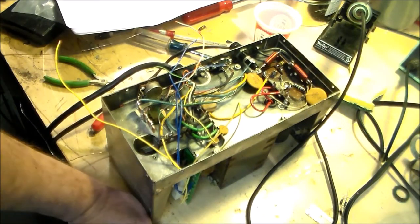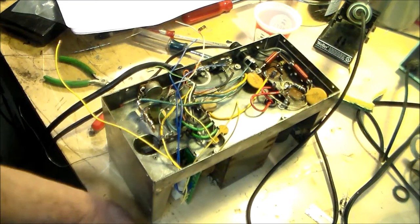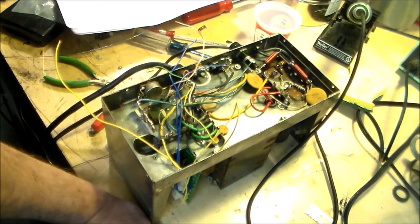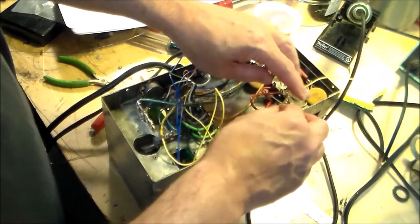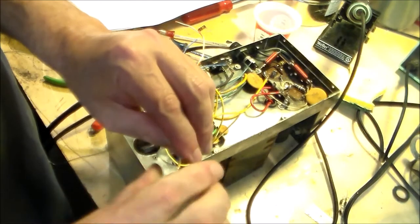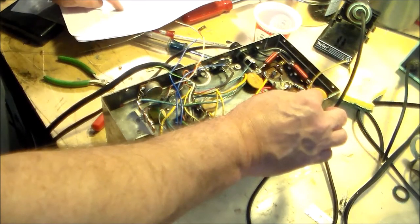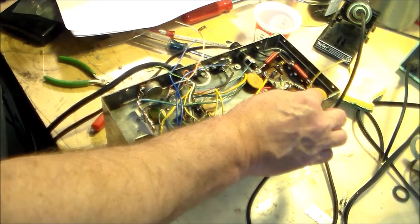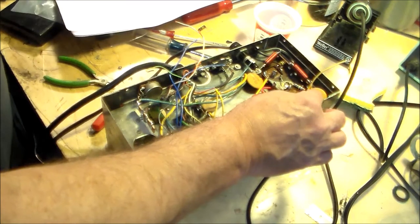Okay. Yellow wire to the small three lug, and this yellow wire is from the transformer. This would be the bottom lug as viewed with the old capacitor holes towards you. Right, bottom lug. And inside of the connection. Connect the yellow wire from the PCB to the large yellow wire at the terminal strip that has the two large red wires from the transformer. This is the strip with the two large red wires and one single large yellow wire.